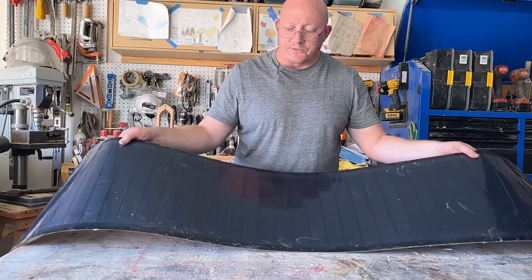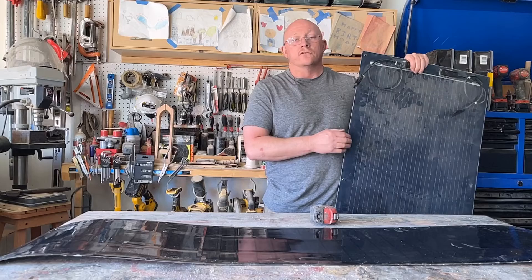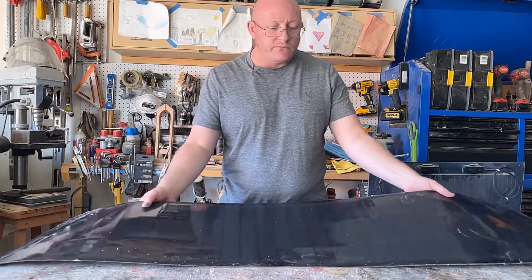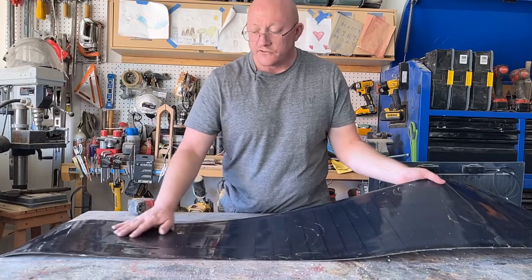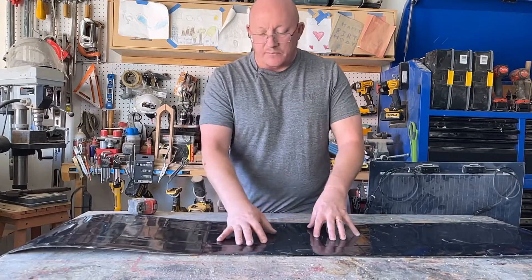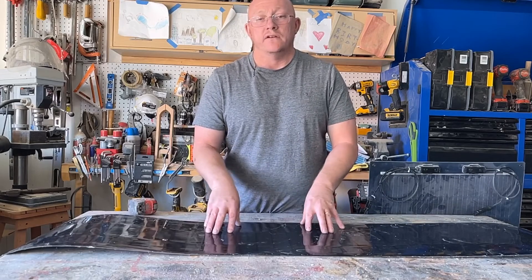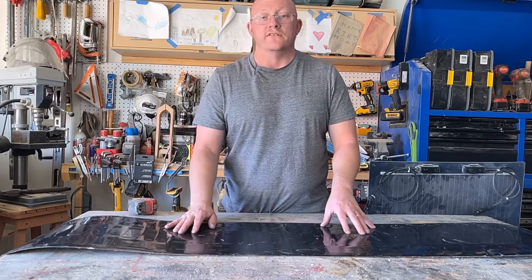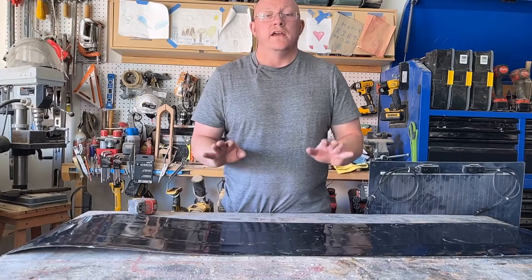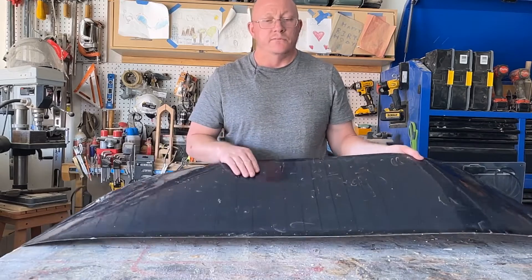The specific application of this would be best served where you absolutely needed the most flexibility, because another very conventional flexible panel doesn't even have near the flexibility that this would. Bouge RV claims that the CIGS material, as opposed to silicon, lasts longer — I can't speak to that, I'm going to take their word on it. But the bottom line is I think this is a really nice panel. It produces really well and has incredibly good production of electricity at different angles than you would expect for a solar panel. I think it's a good panel overall, and if you had an application where you really needed some big bends, this would be really the one.